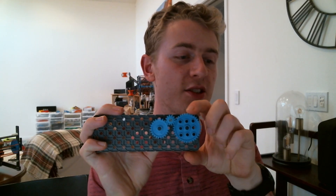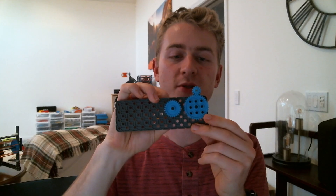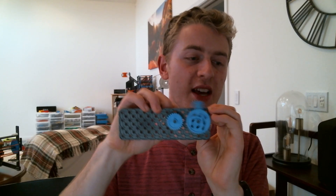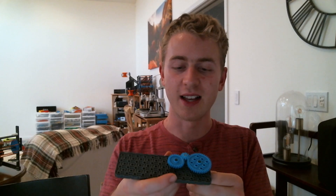This one is probably the simplest. You look at it and you're like, it's a set of gears. But check this out — if I spin this gear this way, I'm going to spin this gear. See how this second gear doesn't spin? It kind of rides on top there. But if I spin it the other way, it forces them to spin together. So I can spin it this way and they don't spin. You'd need like some kind of upper hard stop here — imagine a pin sticking out to hold that in. Then you spin them the other way and they lock together and spin.